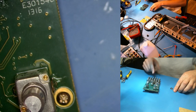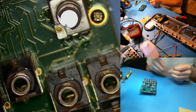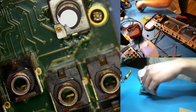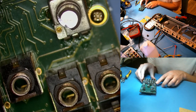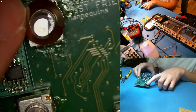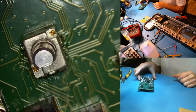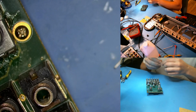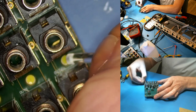On these older modules that use the kind of jack we just replaced, the parts are ever so slightly — about a millimeter — shorter than the jacks in terms of the faceplate. So if you don't have anything to balance them out with washers, it can cause the faceplate to be bent as it all gets tightened together. Now another tip as we reassemble: getting the light pipes in.